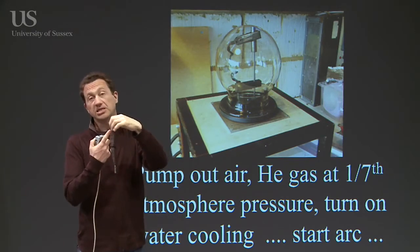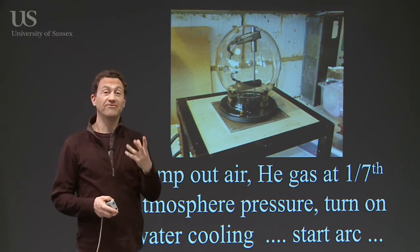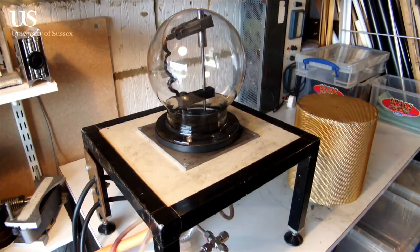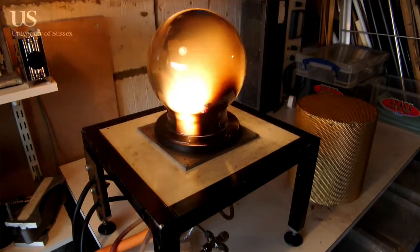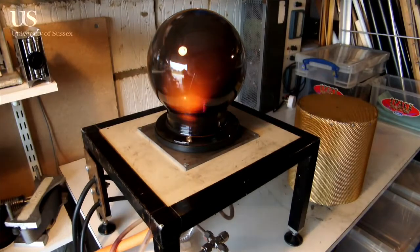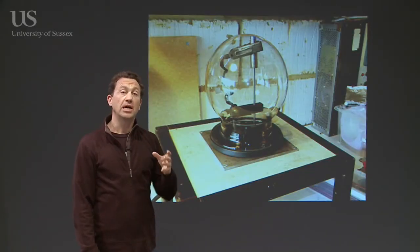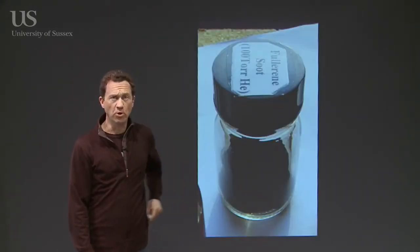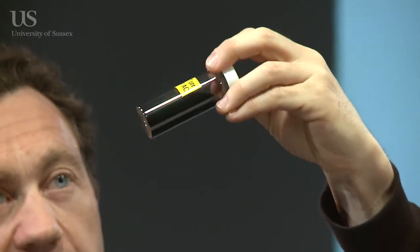At the contact, you get a spark, and that spark is several thousand degrees — maybe 2,000 to 3,000 degrees — and it vaporizes the carbon to produce lots of fluffy black soot-like material. I've got a little video showing what's going on: initially the glass bell jar is completely clear and clean, we apply an electrical current and get this incredible white arc, and you can see the carbon being sputtered off from the electrode, covering the inside of the bell jar with soot. When finished, you let it cool down, let some air in, open up the apparatus, and scrape out the black soot.